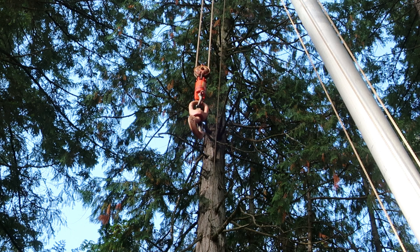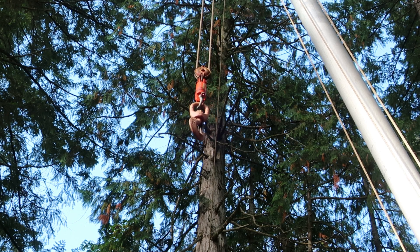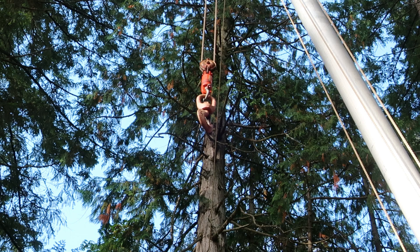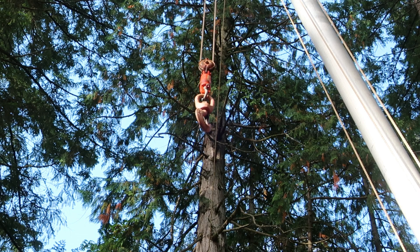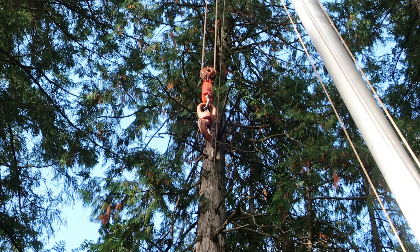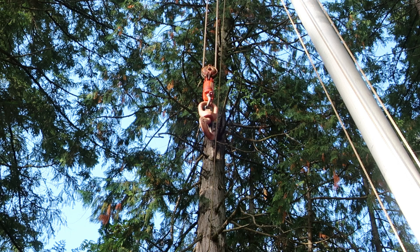One more thing to keep in mind: it's good to have a swivel on your hook, and it's important that you have enough weight on your hook or block to be able to pull all the rope up the boom. Otherwise, when you pull your hook to the top of the boom, it won't have enough weight to bring the hook back down to the ground. The more you reeve it, the more the block is going to have to weigh to compensate.